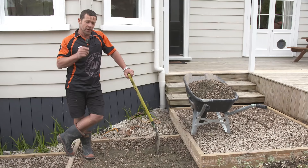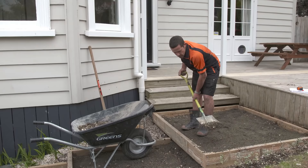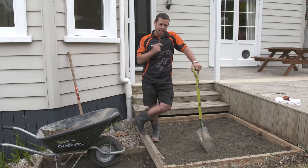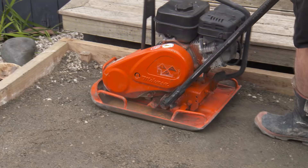In this particular situation, all my borders are already defined by this boxing. So if you're at home and you want to do a strip of pavers down the middle of your lawn, you might want to run a couple of string lines first so you know the exact area that you're going to be digging out. I was pretty lucky here — underneath my old stones were some fines, so I'm going to get the compactor in and compact that down to around 25 millimeters of fines.